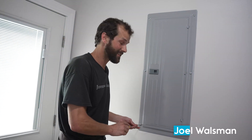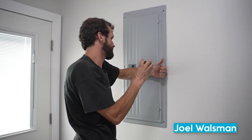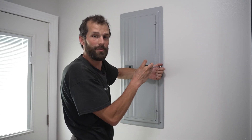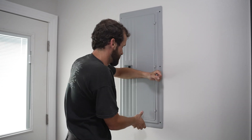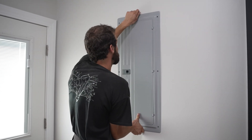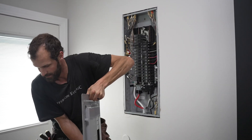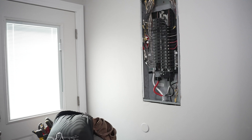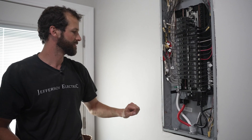Let's take the electrical panel cover off. Left forearm is braced against the panel, last screws coming off. You do have a big hunk of steel and conductive energized parts right behind it, so nice and easy. Rock that baby off — there it is. I usually put the screws right in the bottom; that's another routine.